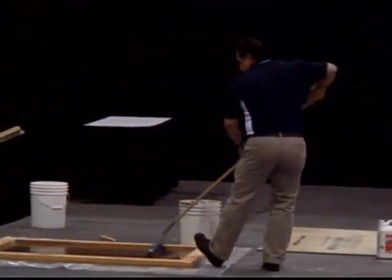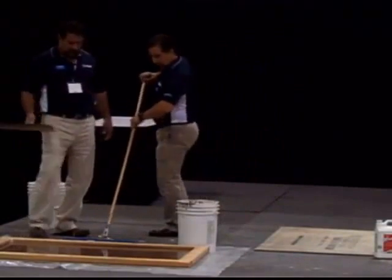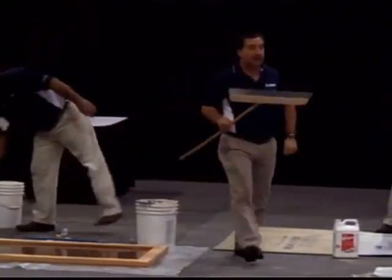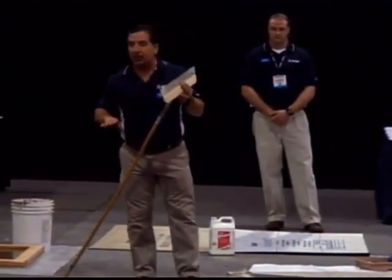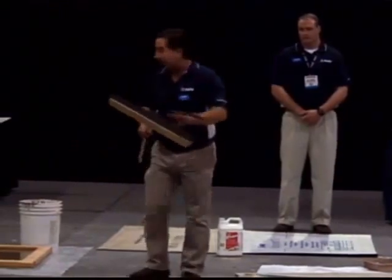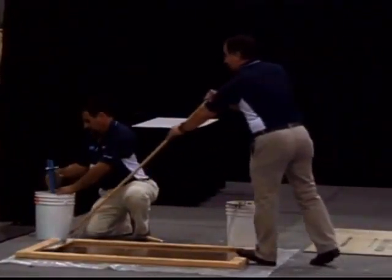When you see the product plow up, that tells you you're putting down a controlled amount of product. Then the next thing you want to do is use a smoother — it's kind of like a big trowel on the end of a stick. This skim coats finish on floors like there's no tomorrow. This is what I use a lot of times when I'm doing a final patch underneath a sheet goods job or something where it really counts to be smooth. The smoother takes out any imperfections from walking on the floor or using the gauge rake.